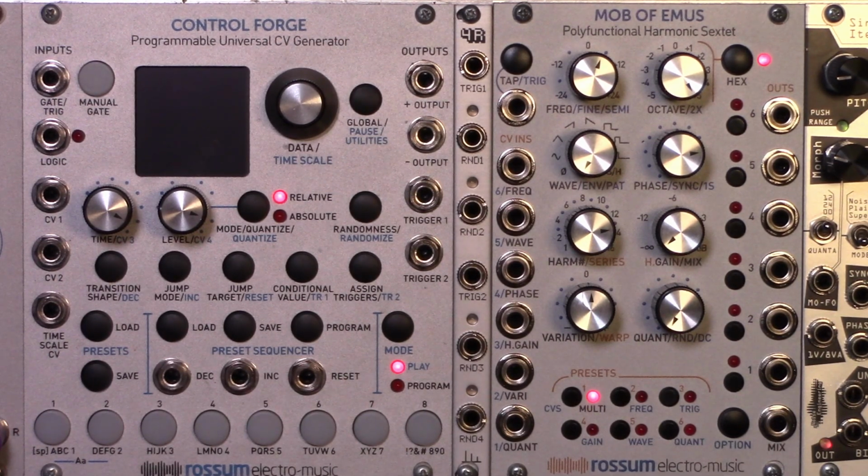So in conclusion, it's another winner for Dave Rossum and the team. They have a very unique approach to classic synthesizers, and I feel this is only going to get better. The only downsides for me are the knob jump behavior, where an option would be very welcomed for many users, I'm sure. The other minor factor is the global CV mode, as it's a potential for having truly independent channels that could be, say, envelopes triggered and oscillators pitched, and so on, which would make this a super Swiss Army knife module, so we'll have to see what the future firmwares may hold.